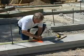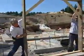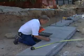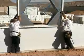Openings like doors that sit on the footing or slab must be installed first. Drive galvanized nails or screws into the back side of the buck to provide shear value. Locate and clearly mark all window openings for later installation of prefabricated buckouts.